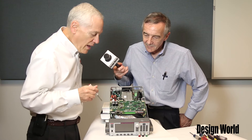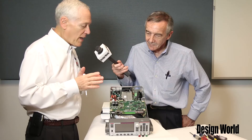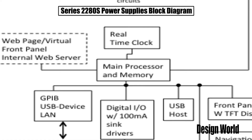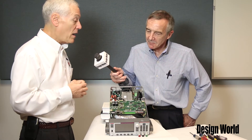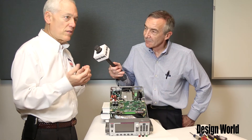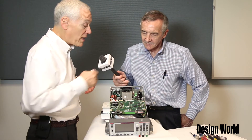This is the digital board. I want to point out that we've got two microprocessors. We use one to manage the communications, the display, and the basic status for the box. And then one processor actually controls the analog circuitry. So we separate the measurement capability from what we'll call the housekeeping capability. That way we can get good, fast measurements. If needed, we can take 2,000 measurements a second in our fastest mode. In addition to the 6½-digit resolution, we also have 4½-digit resolution. So you can make a choice if you're interested in fast measurements or if you need slow measurements for maximum accuracy. Our operating system is a Linux-based system.